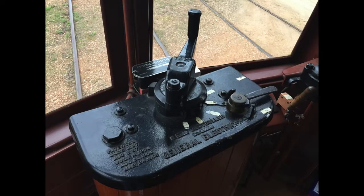We will first review the location of the various controls on the streetcar. To the left is the main controller. As the motor man, you will be using this for both forward motion and reverse motion. It is in the off position, but has five levels of speed. There are 600 volts of electricity running through this controller. The speed is regulated by a resistance device under the car.